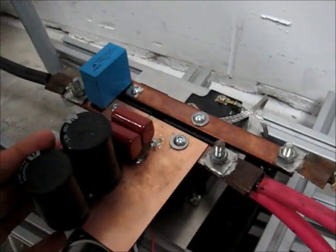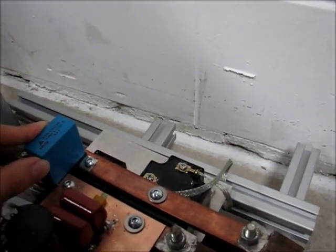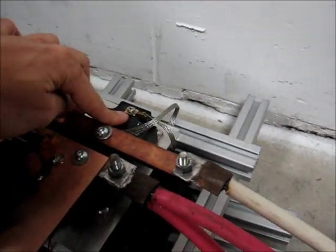There is the same capacitor bank, just on a different circuit board — 0.68 microfarad, 1250 volt caps. And this is the freewheeling diode in this case.